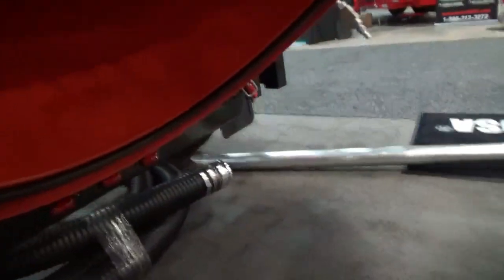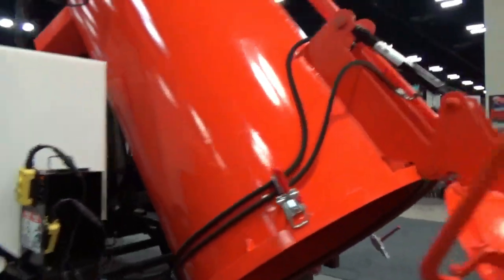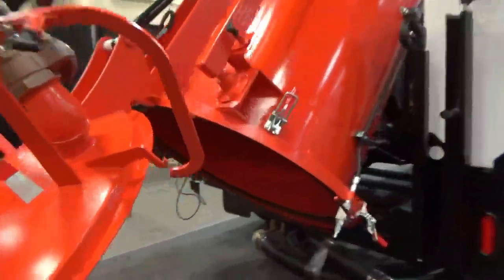Up inside here we've got a three-part washout system. The bottom is a switchback blade — a side-to-side washer. We hook the washer to it and you can blast this out with cold water or hot water. One of the huge problem areas is dumping this tank, but look at that angle — you've got a fabulous angle, almost parallel. Now I want to show how that washout hooks up. We've got the valve right here, and it goes around our flush system.